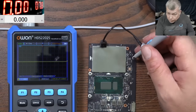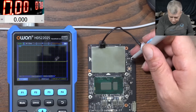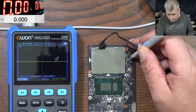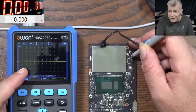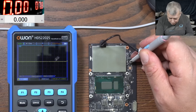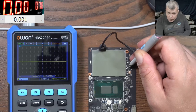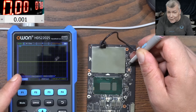The communication with the BIOS is not continuous — it reads the BIOS at the beginning and that's it. So you can stick the probe on basically any pin from the BIOS chip and you should see some communication. I'm plugging the charger now. You can see the signal — and one more time. You can check basically any pin from the BIOS. Now I'm plugging the power back. You can see there is communication between the chipset and the BIOS — the chipset is reading the BIOS.